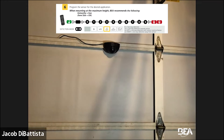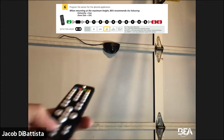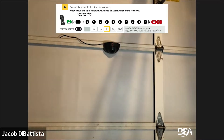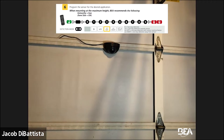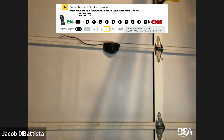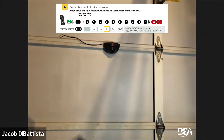There's also a uni away with MTF feature. Motion tracking feature with the uni away — number four is regular away, and number five has the motion tracking feature. As you walk toward the sensor, nothing happens; as you walk away, it detects you. And with MTF, as long as you're moving back and forth toward the sensor, it sees you every time. Setting it back to uni-directional is done the same way — unlock, bi-directional arrow, select two, then lock.